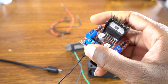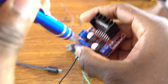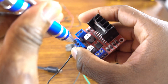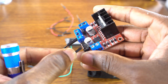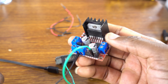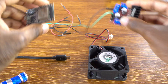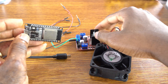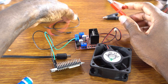The ground of the ESP32 board — you attach it through this jumper wire to the ground of the driver, the L298N DC motor driver. And the green wire is attached to input IN3 of the DC motor driver. The green wire goes from GPIO 15 to IN3.